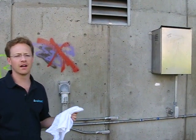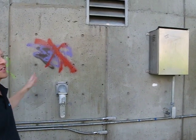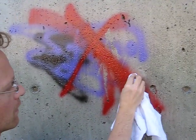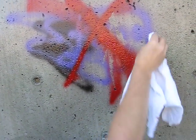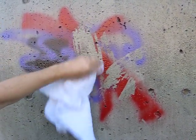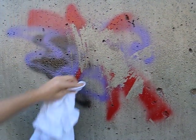It's been about an hour and a half since we put this graffiti on. We're just going to do a quick removal with a dry rag, just to make sure that we're getting the release properties that we want off the substrate that has the best color matching and maintains the best color integrity with our sealer and our proofer. Just dry cloth here. You can see the graffiti — the paint — can't gain any adhesion to the substrate because of the proofer's release characteristics. There is no product on the market that can come close to this kind of removal performance with a dry rag.